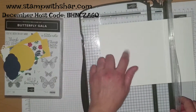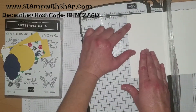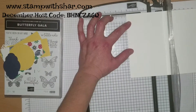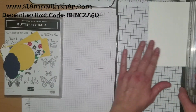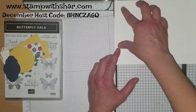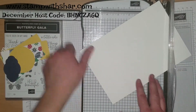We need to score this piece. This piece is going to be scored at two and an eighth — that's two inches and then two tick marks. You can either rotate it 180 degrees and score it again at two and an eighth, or you can open it up and score it at six and seven sixteenths — that's one tick mark before the half inch. Because there's a divot, it's easier to just rotate it 180 and score it again at two and an eighth.